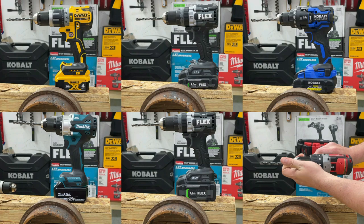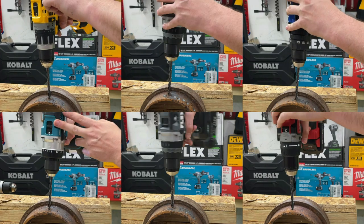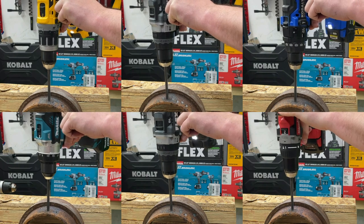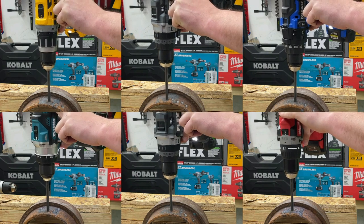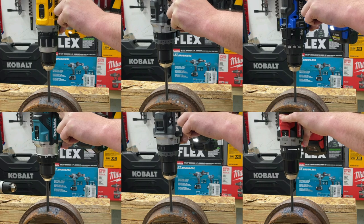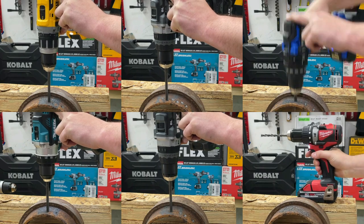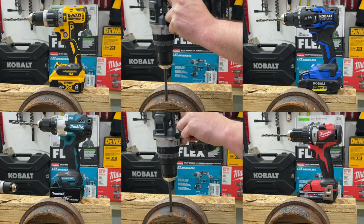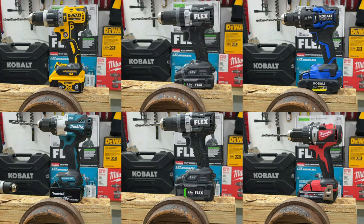The first test is drilling through metal — this is all about safety, efficiency, and RPM and drill bit selection. Make sure you lock in that drill bit securely, tighten it all the way, and click back once. We pre-drilled pilot holes, and notably we didn't turn the turbo off on the Flex — this is where the Flex will really flop, because those high RPMs are not where you want to be drilling through metal. We're using an 11/32-inch 135-degree cobalt bit without lubrication, causing a lot of friction. That punch-through is serious business — you've got to make sure you're not pushing too hard or you'll rip your arm around or break the bit. Make sure you're choosing safety, slow down, and pick the right speed.